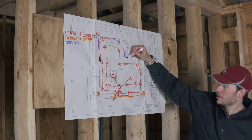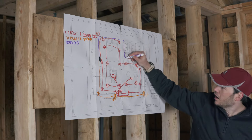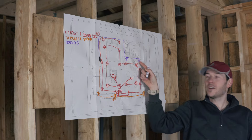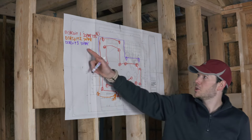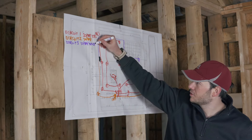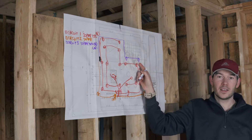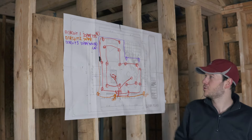For circuit three I'm going to start here, go all around through the bathroom wall, have one outlet for the fridge, and one over-the-counter outlet for probably a microwave. This is going to be a 20 amp circuit with 12-2 wire, and it needs to be both arc fault protected (AFCI) and ground fault protected (GFCI) because you're going to be next to the kitchen sink.